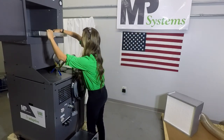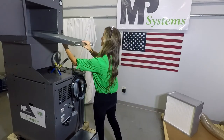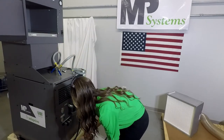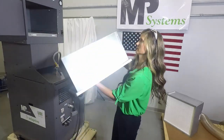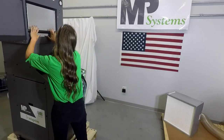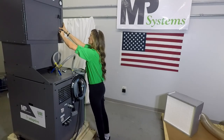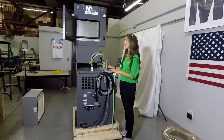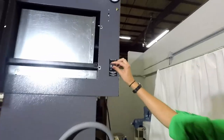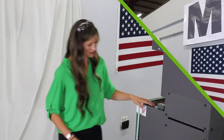When you wire the mist collector through our pump like I did in this video, the MP1200 will automatically run at a set speed when the high pressure is active. When the high pressure turns off, the MP1200 runs for an additional 20 seconds at max speed. The MP1200 setting can be modified through the PLC to your preferences. Our unit is adjustable, which is a great feature — you can use this knob right here to change the CFM of the mist collector.